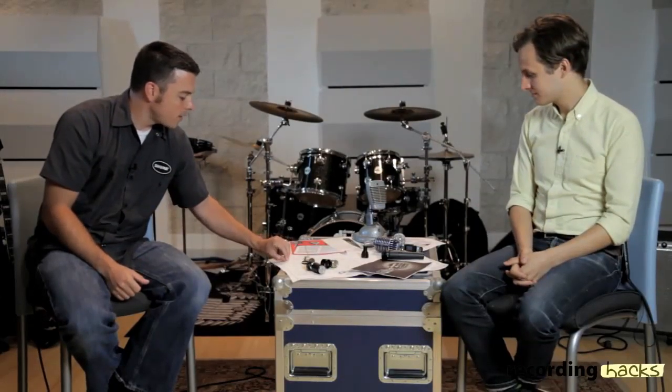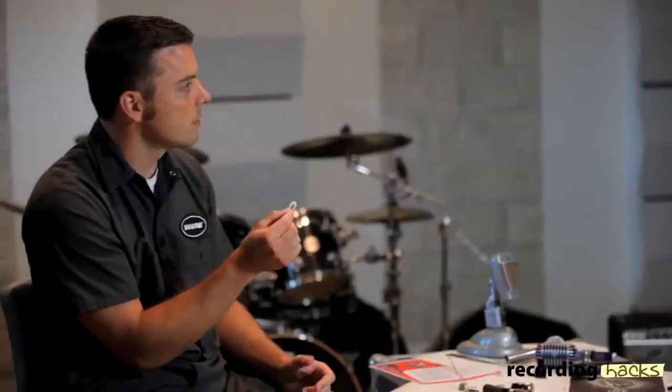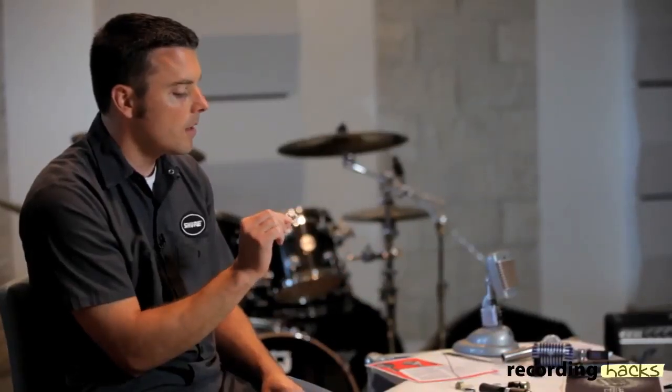So we need to damp that down, and we do that through a couple ways, but the biggest way is creating a cavity behind the microphone. So we create air volume behind the microphone. We also use some resistance materials under the microphone to help damp down that resonance. Acoustical resistance materials. It could be cloth. We use a lot of resistance cloth that is tuned to a specific resistance value. It has a certain acoustic impedance to it.